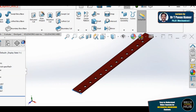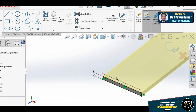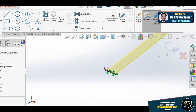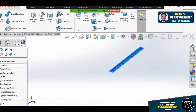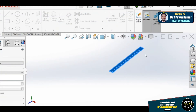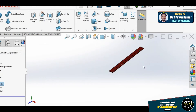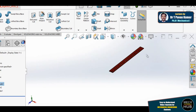Let me go to the sketch of sheet number 1 so that you have a clear picture of the exact dimensions maintained. Sheet number 1 has 4 mm thickness — T is equal to 4 mm — and a width of 50 mm. The sheet got extruded up to 500 mm. This is the information about sheet number 1, which has dimensions of 500 × 50 × 4.